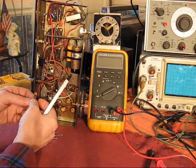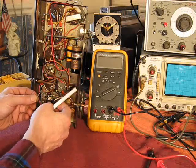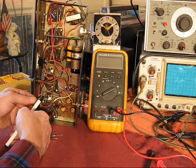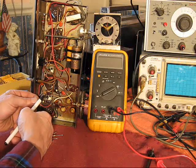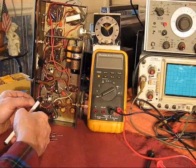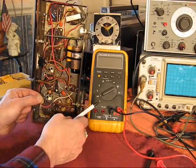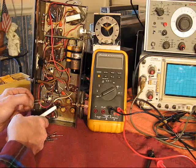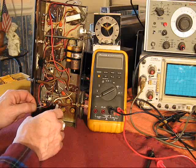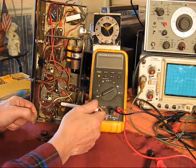I replaced this disc. It's an RMC, Radio Machines Corporation, I think it is. 20%, not very close tolerance. 47 picofarad, and it's a temperature coefficient of N220. 220 parts per million negative with an increase in temperature, which isn't unusual when using these to complement coils such as this. This is the oscillator coil, AM oscillator coil.